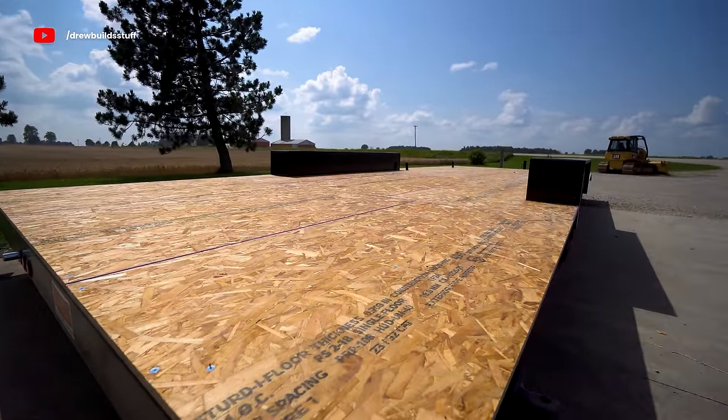Then I'd cut my cut line and cut just the bottom portion of this bend line. And then I'd use my square to score a line along that bend line and use a handbrake to bend that over 90 degrees. Then I just transferred on that second vertical measurement I took and cut along the bend to this point and then just bend this over roughly to the slope of the roof. Then this cap just slides over the end and I just put one tack in it for now.